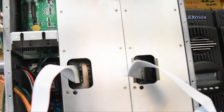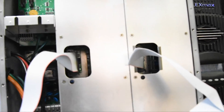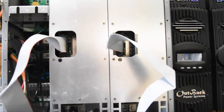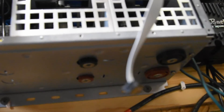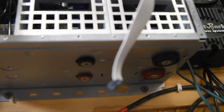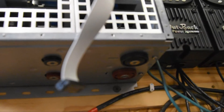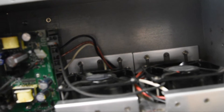It's very difficult to pick it up and set it on the bracket. If I had known, I would have taken these power modules off first, and I'll explain how you do that since I've got to replace one right now. You get a wrench and channel locks and take both of these out. You just grab hold of those and take those off — that's what holds them on the bottom. On the top, you'll see there are two fans. Take off the fan on the side you're removing; there are two 10 millimeter bolts behind it. That will let you pull the power module out, and that is the first step.